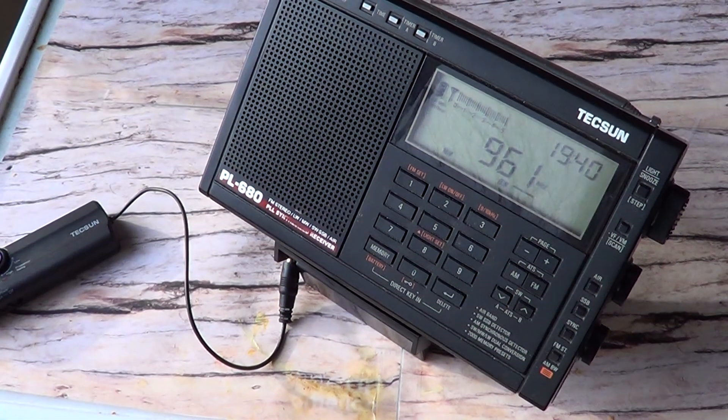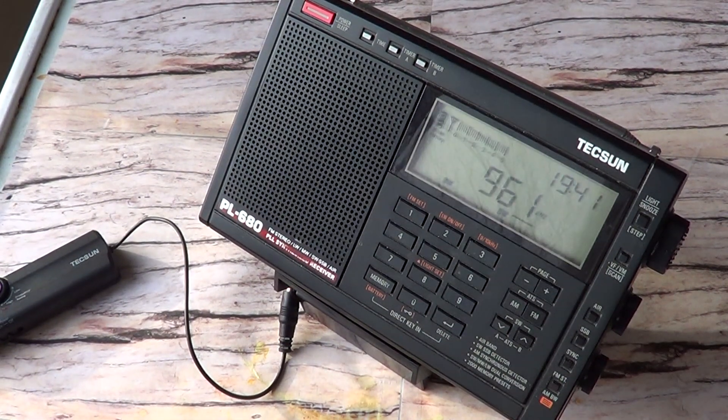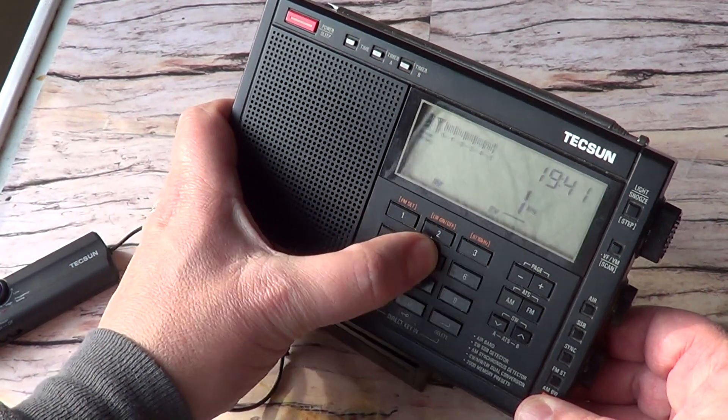Position the wire differently as well. That's a drawback for shortwave, long wave, and medium wave — though here in our demonstration we are on medium wave. The long wire makes it more difficult to tune in sometimes. The idea behind providing so much length is so you can have the antenna on one side and sit with your radio in a comfy chair across the room, but the problem is it adds a lot of noise to the whole system.